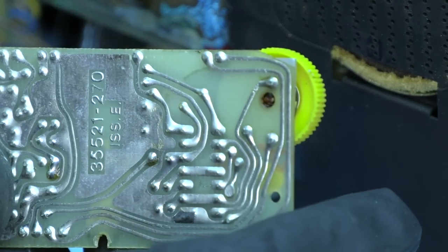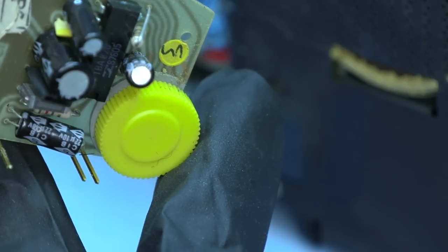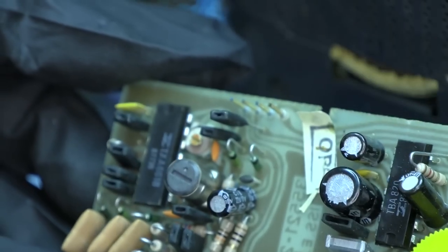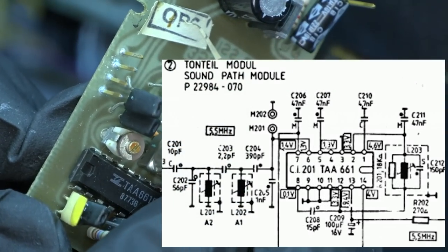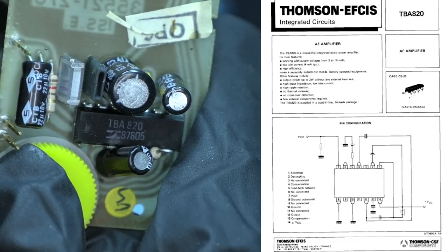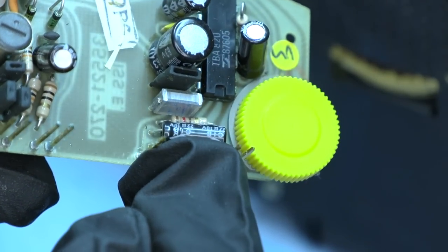Here's another board — this is the audio board. That's volume — little pot there. That's just like transistor radio type setup, where they have the thumb wheel kind of inverted. Single-sided board — only need single-sided for the audio stuff. Got the chippage: TA-A66-1B — have to look that up. It's got a tuning slug right there. And the other one: TBA-820. You've got a nice metal film stacked capacitor there — that's a nice little bit of kit, I really like them.